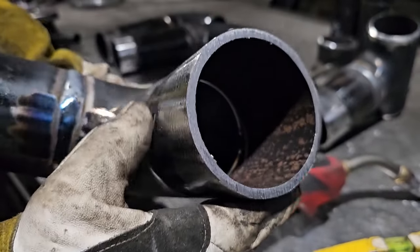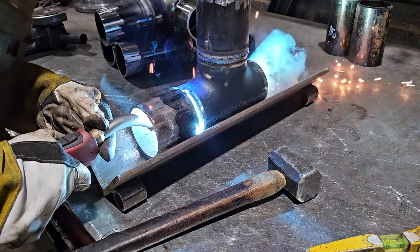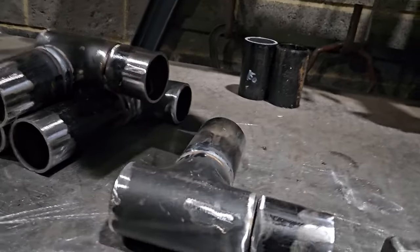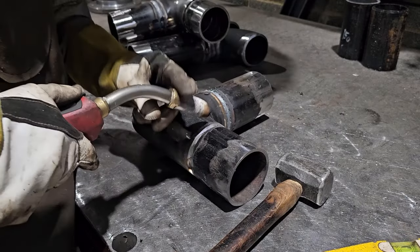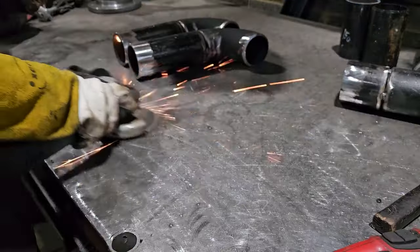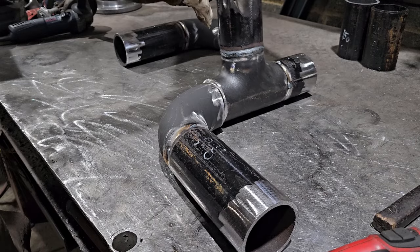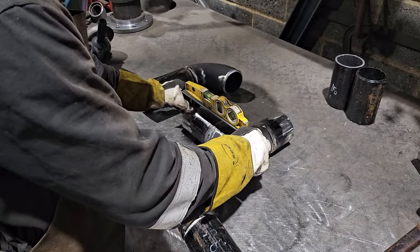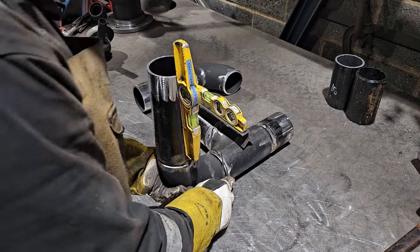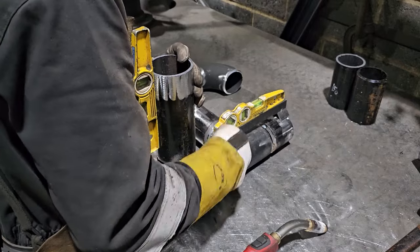You can see how much penetration I get from the tacks welding inside to outside - it penetrated nicely. This method of fabrication on the table does come with drawbacks: if your pipe isn't exactly the same size as your fittings, you have gaps. The tee is perfectly on the table and the pipe is ever so slightly floating, about one mil in the air. For cases where the gap is bigger, I'll put down a little shim to split the difference, because I really hate using the vise.